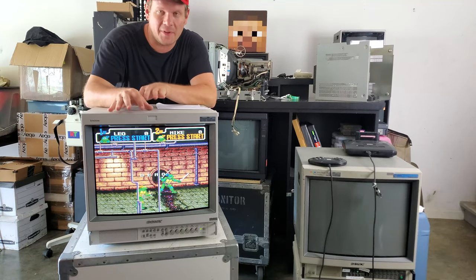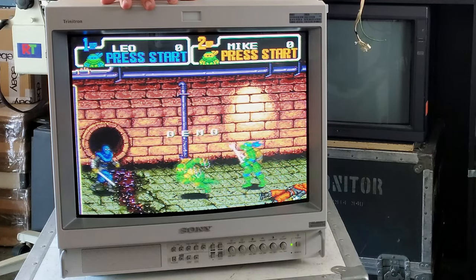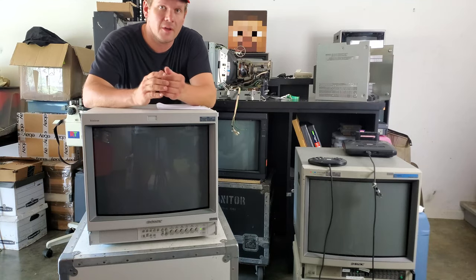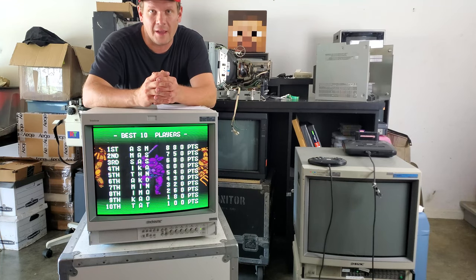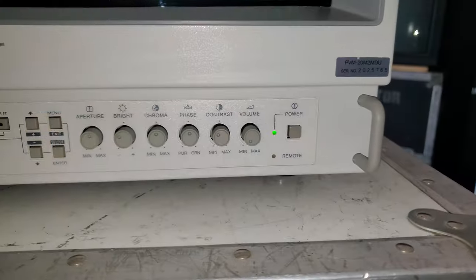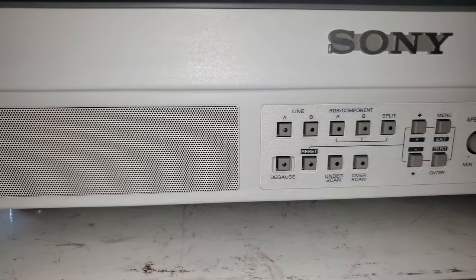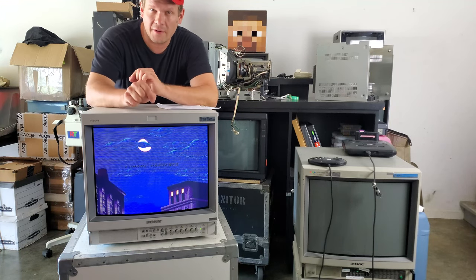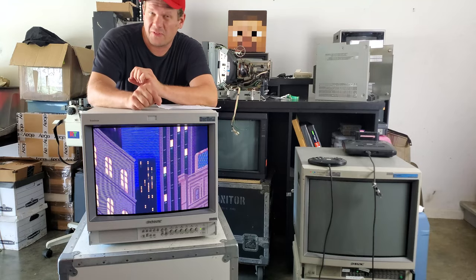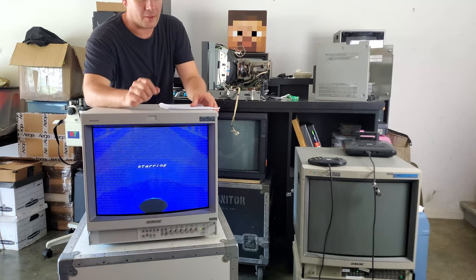Some of the pros: it has a nice built-in service menu which is highly adjustable, so things like adjusting horizontal and vertical centeredness or making adjustments to corner geometry are pretty user friendly — much easier than other models that don't have a service menu. It offers a variety of color temperatures and supports nearly all types of sync output by gaming consoles, specifically ones that are troublesome on other monitors. This one seems to be the most forgiving of all the PVMs for sync adaptation and compatibility.